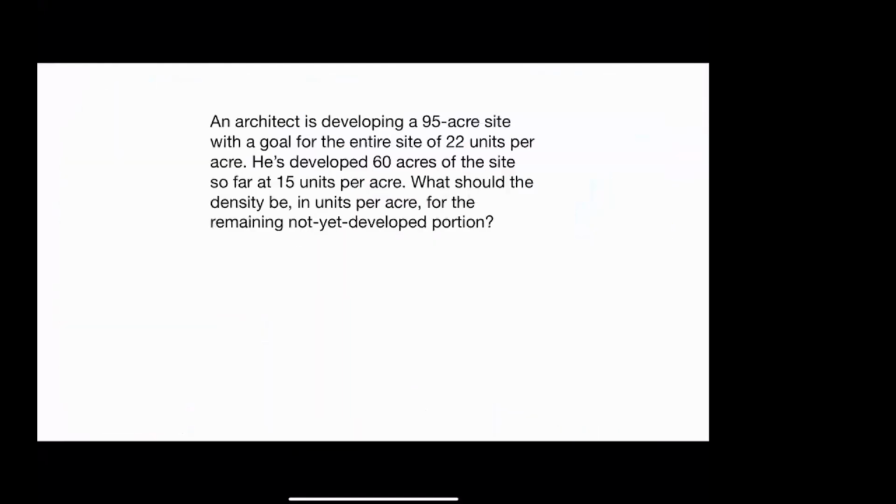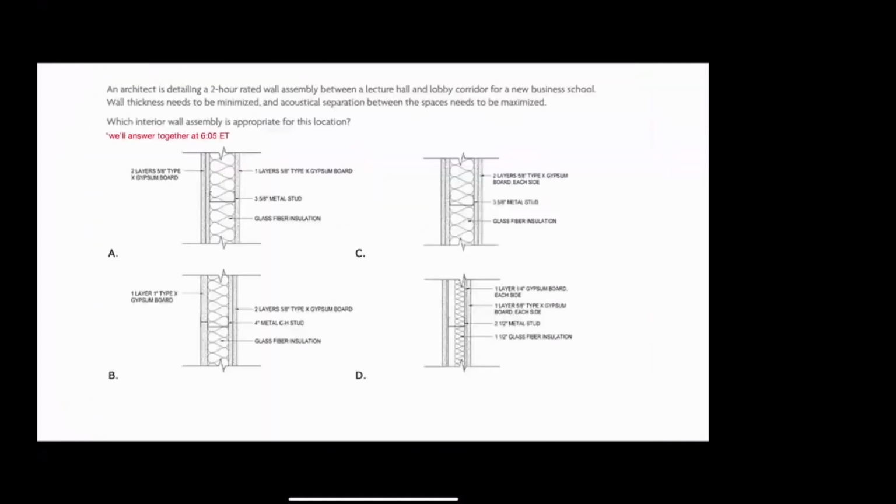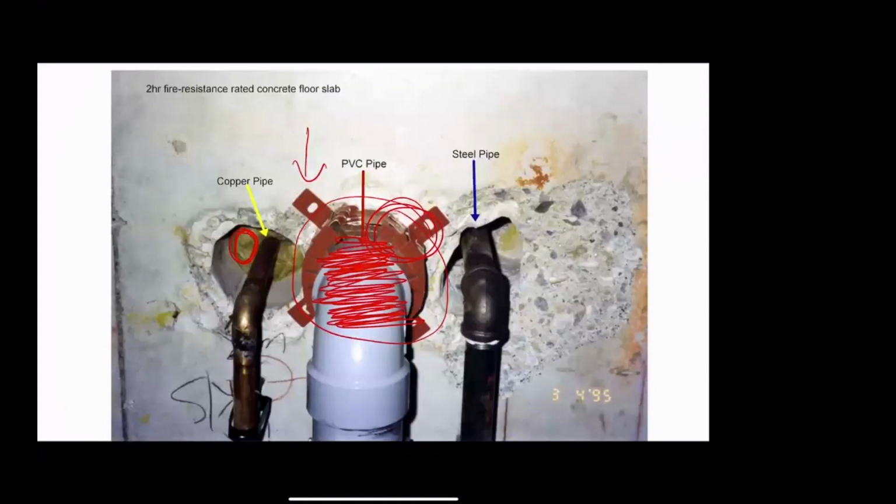Hi. So what I saw from today's lecture, in terms of the firewall, barrier, and partition, was directed towards their physical characteristics, right? I mean, the separation between the firewalls and then the height of the barrier. Well, not height, but coverage of the barrier and partition. Is there an hour rating applied to each of these? I guess what I mean is, are firewalls 3 hours, barriers 2 hours, and partitions 1 hour, or is that not the right way of looking at it?